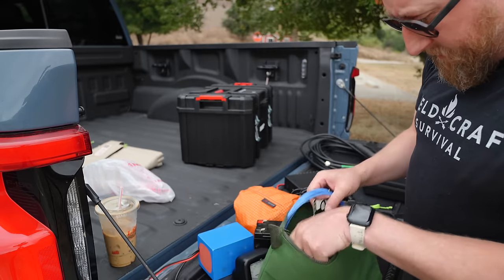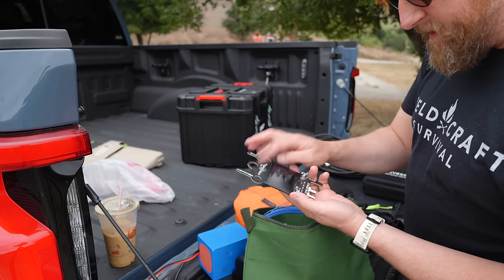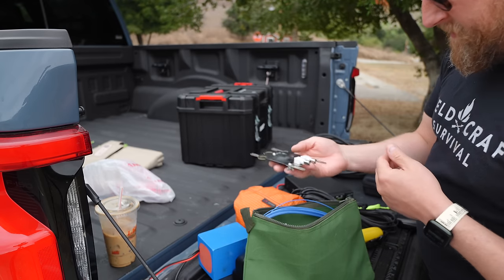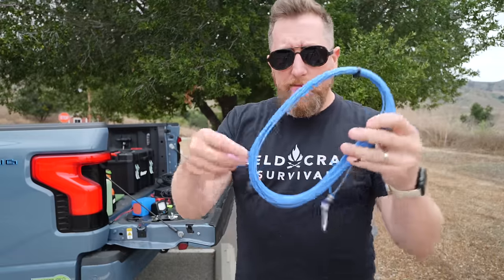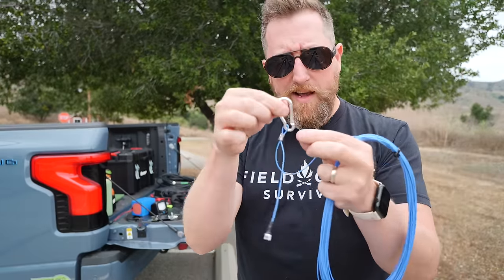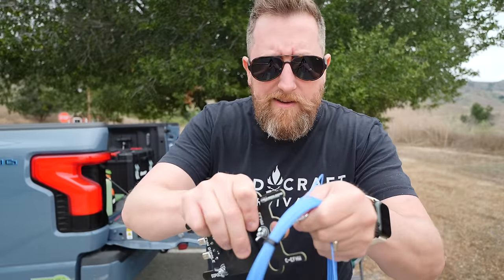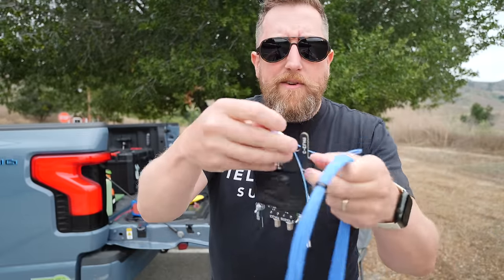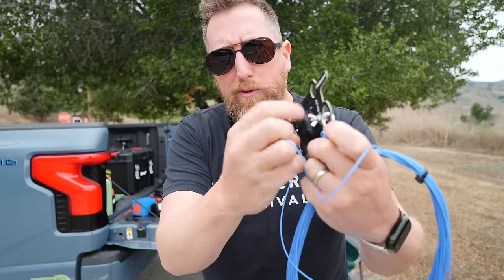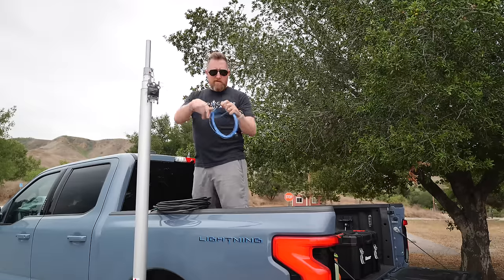Chameleon sent me their new LEFS antenna. So this is going to be configured in the end-fed half-wave configuration, not the dipole, but you could do either end-fed or dipole. So let's get that set up. Kit comes with some nice wire terminated at the end on one side, terminated on the other end with a load-bearing carabiner, and then a part that connects to the antenna. So we just go in like this, clip, and then this can go around and connect to the flugel nest, as we like to call it. Hang this off my tactical Mastworks here.